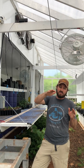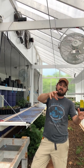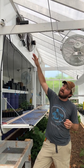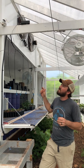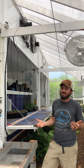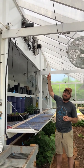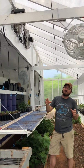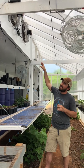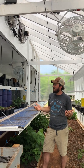This allows the greenhouse to let hot air rise, pulling cool air in from outside and rolling it out of the top of the greenhouse. We also have some active ventilation because it's a greenhouse in South Carolina — so at 85 degrees, these active fans come on. Those suck air through the vents and exhaust it out the top of the greenhouse. That's the way this thing works.